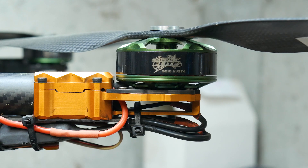Here we have the motors. These are multi-star elite 5010 274 kV — a really excellent motor. I've been flying them over three years, changed the bearings one time, that's about it. I've been flying eight cell and six cell on them with an 18 by 6.1 carbon fiber prop. They handle the weight and the demand just great. After about a 30-minute flight they're a little bit warm, just a little bit, but they're a really great motor.